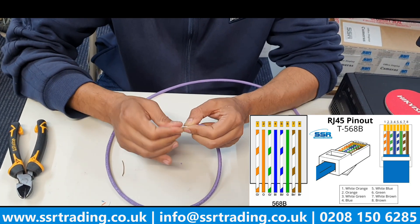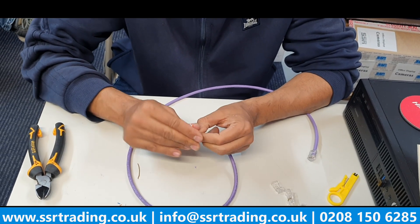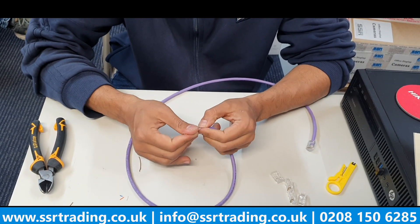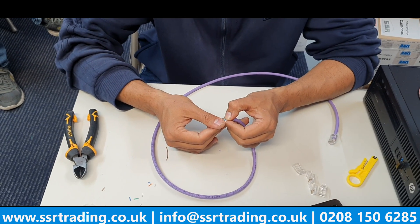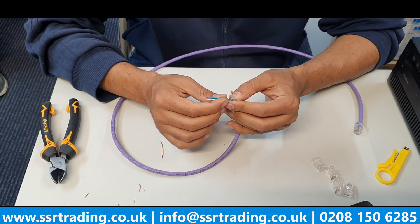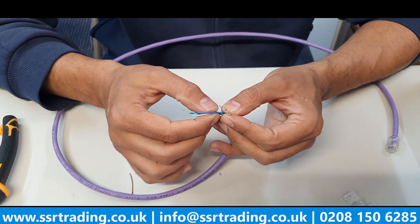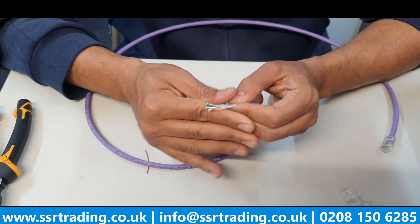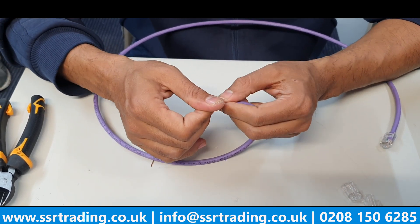The main thing here is to keep rechecking to make sure you are doing the cabling in the right sequence. I'll bring the cable around from here so it has a much stronger push towards the RJ45 plug, because sometimes the cable bends inside the plug and we don't want that - we want to make sure it goes straight and slides outside through the pass-through plug.